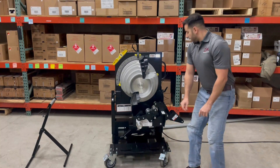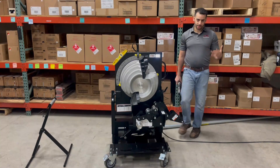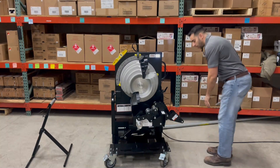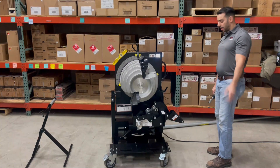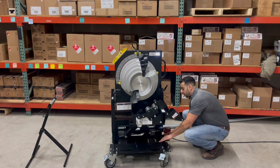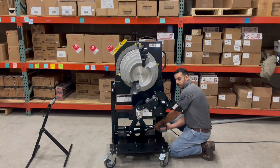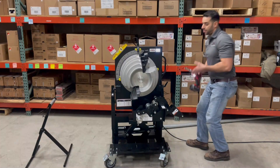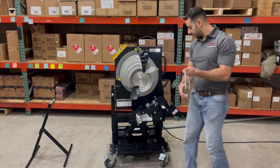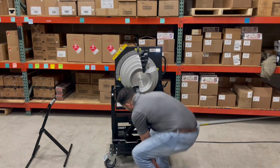Fork pockets down here — and this is probably one of my favorite features. If you're bending strenuous lengths of pipe all day, one complaint is your back because you're constantly bending over. This bender has a scissor jack incorporated, which is proprietary to Southwire, and it works with a three-quarter inch socket. You can raise it up for taller operators or bring it back down quickly for shorter ones. If you don't have a drill, it does come with a hand tool that's housed right on the unit.